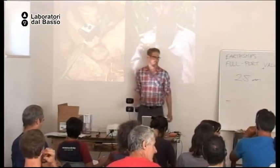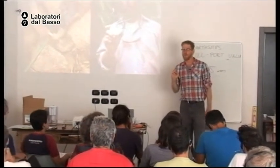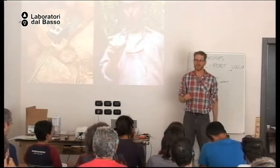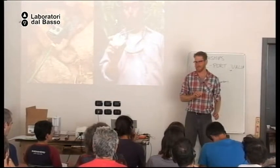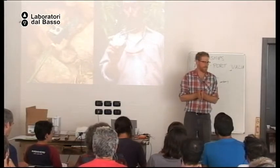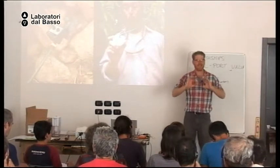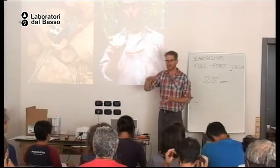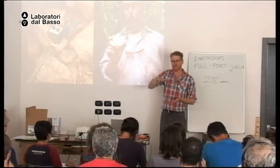You can also get a timer. But with a gravity-fed system, you cannot use a timer for a drip irrigation system that is made for pressurized water. Most timers are made for a steady pressure. But in a gravity-fed cistern, the pressure is always changing based on how much water is in the tank.